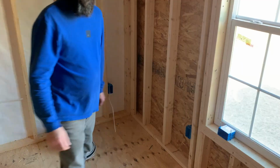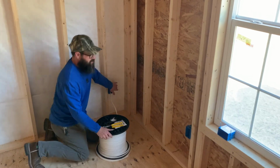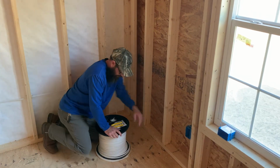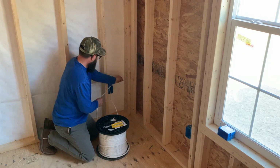And then the very last step is we'll put the no-nail plates. So once everything is finished, you put a metal plate over the stud so that you can't put a screw or a nail. So if you're doing electrical, make sure you don't make a mistake and leave out a cable. Yeah. We caught it in time, but...